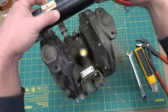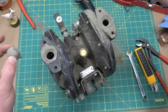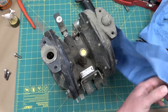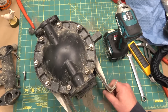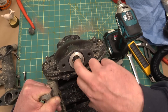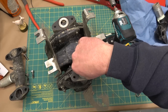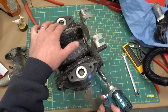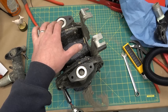Now what horrors lie within here? There might be some gold in there. Here are two of the check balls, still seated despite all that sand in there. There'll be two check balls on the top, two on the bottom — if these don't seat properly, it will not chooch. Here's the inlet, packed right full of the good stuff, and we can see why I set this aside. If one of these check balls doesn't seat, the whole pump is hooped. Plainly obvious — these are built with maintenance in mind. A couple of bolts just to get the big ball bearings out, clean it up, and she's back in service.